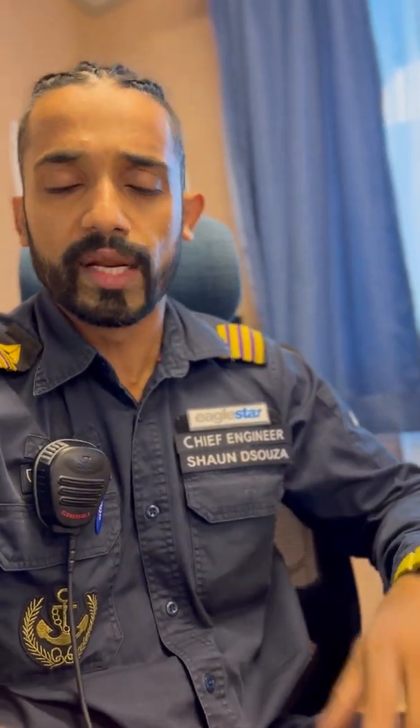I am just editing the video with some free time in my cabin before I head down. So the basic tests done by a lab representative who comes to draw your samples on board are: temperature, pH, free chlorine, total chlorine, and if it is an OWS discharge, he will do an oil content test as well. He draws one sample on board at the same time, and for the lab test he draws samples into special bottles — plus another bottle for himself, which he uses on board to test and verify that both results are parallel or as close as possible. This verifies the integrity of the test and gives us a fair picture of what to expect with the results.